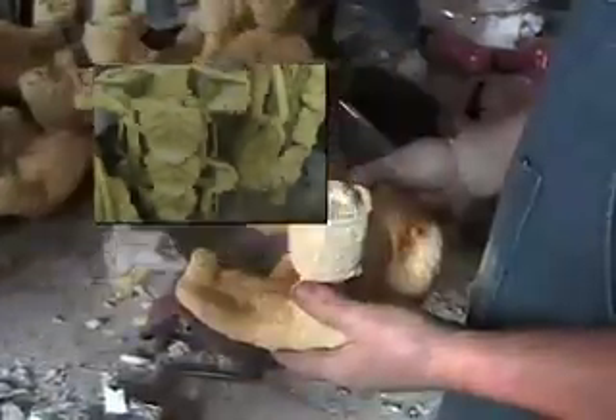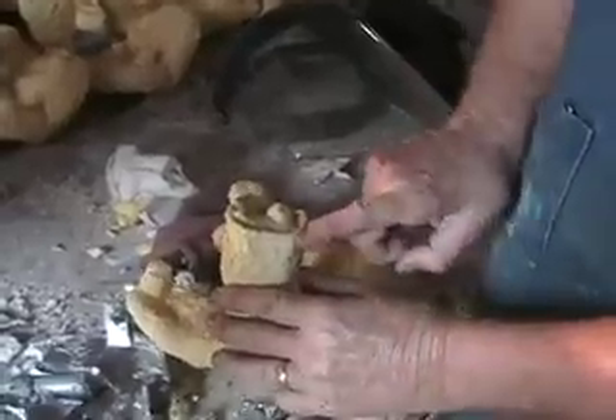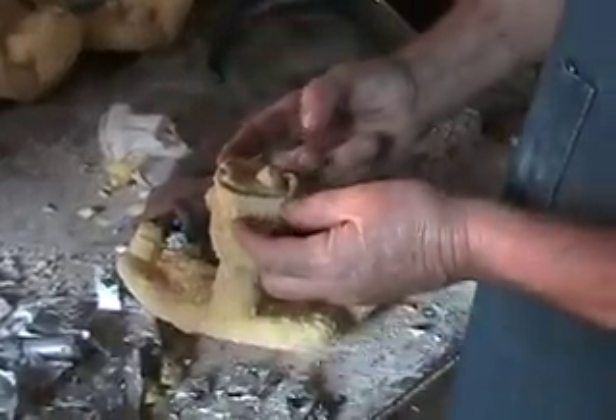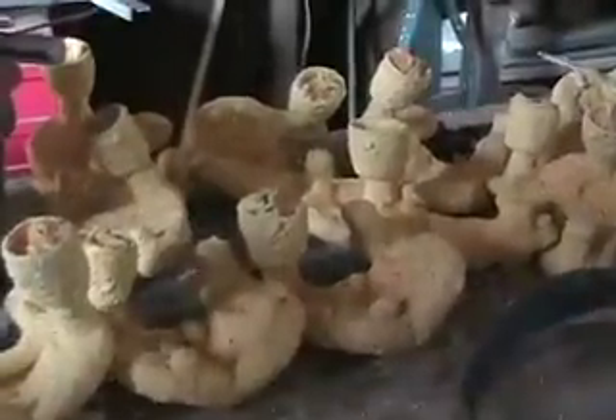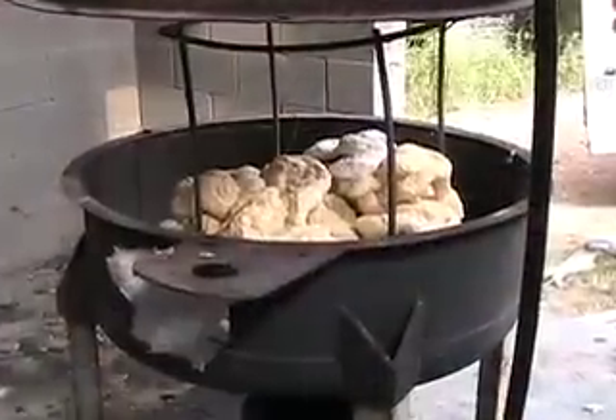After we go through the process of dipping, we'll take the ceramic mold at that point, which is still green, and we will cut off at the top of the main sprue rod the ceramic material around that rod — that metal rod that's down inside. We'll take it and turn it upside down. We'll do the large tank, which is called a burnout tank.